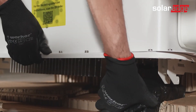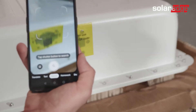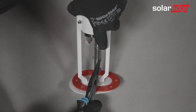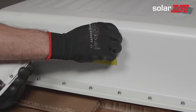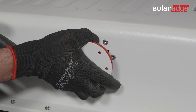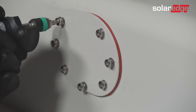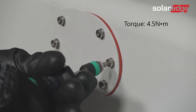Next, remove the fire extinguisher located below the battery. Then scan the QR code on the sticker to access the fire extinguisher quick guide. Straighten the fire extinguisher's security pin and then pull it out. Now remove the sticker from the upper part of the battery and gently insert the fire extinguisher into its correct position, ensuring that it can slide through the leaders. To complete the fire extinguisher installation, fully tighten the seven M5 screws supplied in the package.